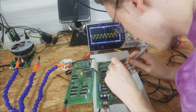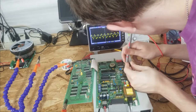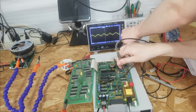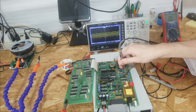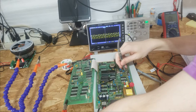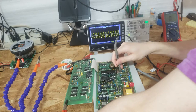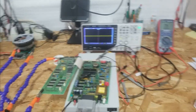There we go, that's pin six. What is it in reverse? 125k. Test point four - looking very strange. Why do all the waveforms look like they're drunk? There's mid-level stuff going on there, I don't know what that's about. That would indicate a problem in my perspective. And then the output of that op amp is definitely not much - pretty bad. I'll also note my camera's a bit crooked too.